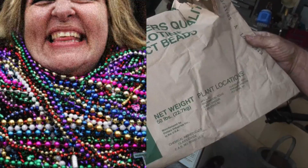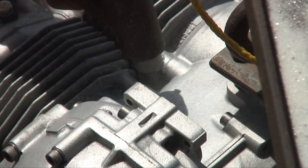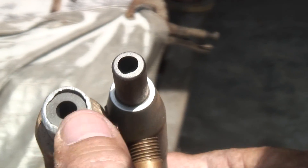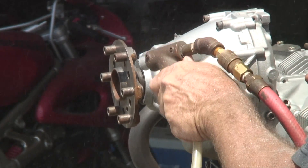A glass bead is just one of the media used for cleaning or prepping metal for further application — whether it's topical, plating, painting, whatever. Manufacturers supply various media: it could be garnet, walnut shells, or whatever. If you call them for information, no help given. I tried a different sandblaster bead blast head — one out of my cabinet at the shop. The orifice size for the air is a little larger, and it's got a ceramic tip that's not worn out. I can tell the difference because I'm bead blasting my arm just holding it over to save some beads. That'll work, but I may need gauntlet gloves. The consumption's back up, but it does clean the dark spots out for sure.